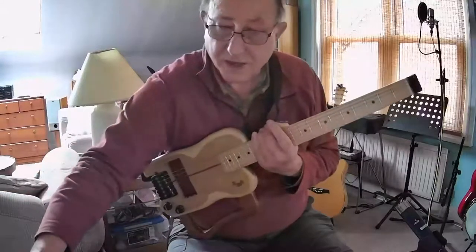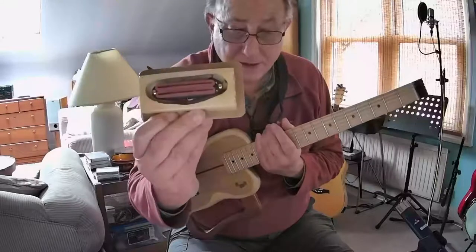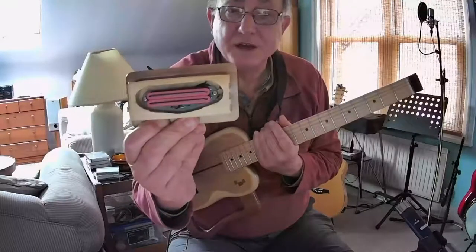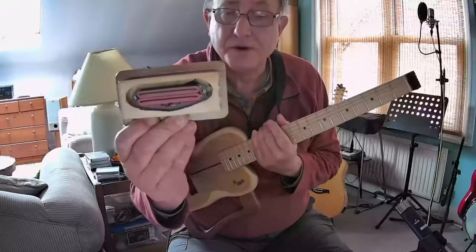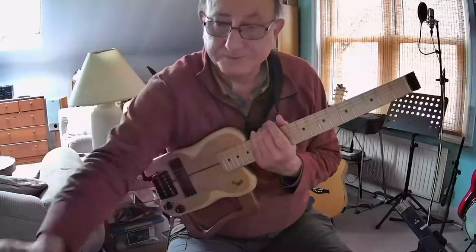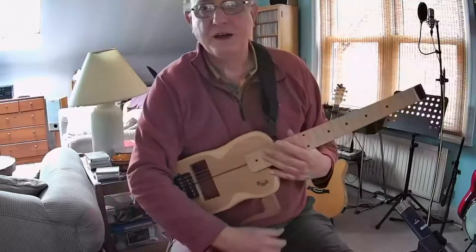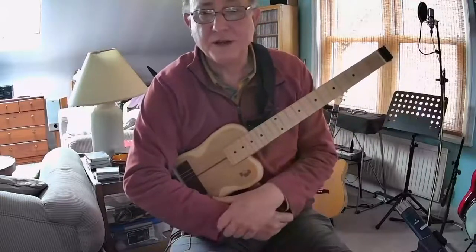I should have told you that this dual rail has a 9.16 kilo ohms resistance when it's not split, but when it's split, it's about half that, 4.62 kilo ohms. So that's six really quite different types of pickups. And of course, they really ought to sound quite a bit different.